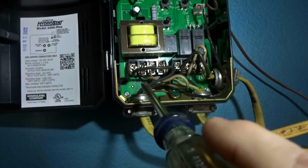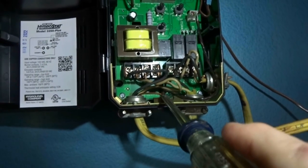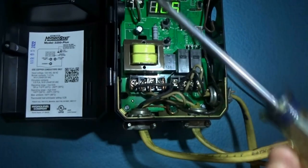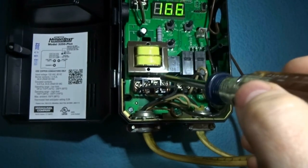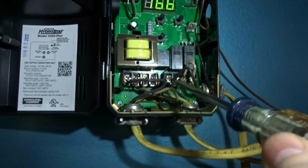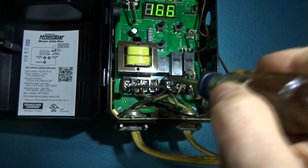If you want to test the voltage: L1 right here is your black hot, L2 is your neutral. You have C1, C2 and B1, B2. Set your multimeter to AC, put the ground here and touch one probe to L1 — you should get 120 volts. C1 is your furnace; turn the thermostat up and touch here after the furnace is running with the circulating pump — you should get 120 volts. Your burner is B1/B2, black to B1, and you should get 120 volts there.